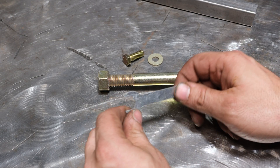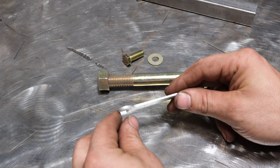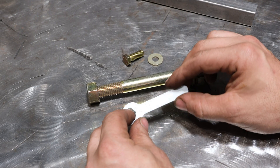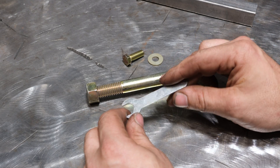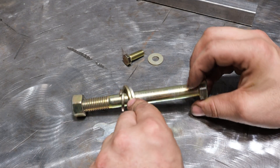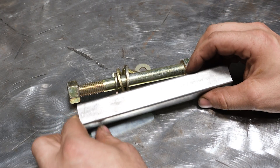Looking at this wrench — it's too heavy to be aluminum, but it does look like aluminum. Zinc can come in a silver form like this, which is very common on nuts and bolts, cheaper bolts. When you get to the grade eights, they're generally coated like this. Both of these likely contain high levels of zinc. If it's aluminum, it's not going to be coated with anything — it might be anodized — but steel is very commonly zinc coated. Same thing with bolts, washers, all of these.